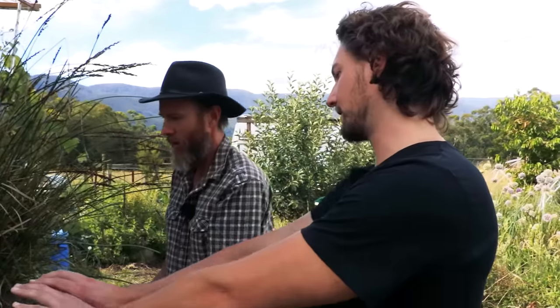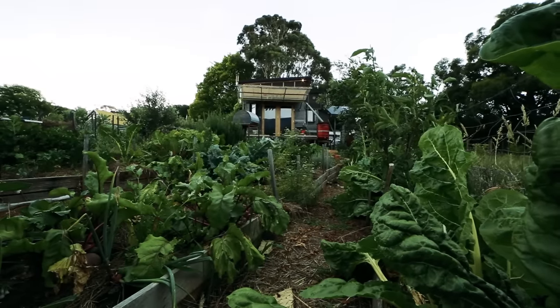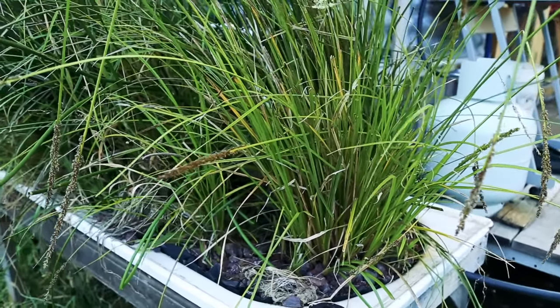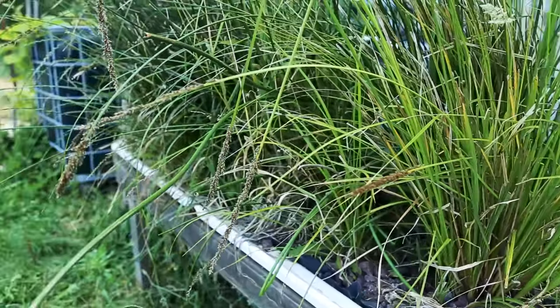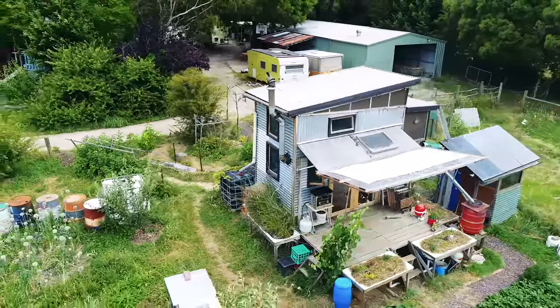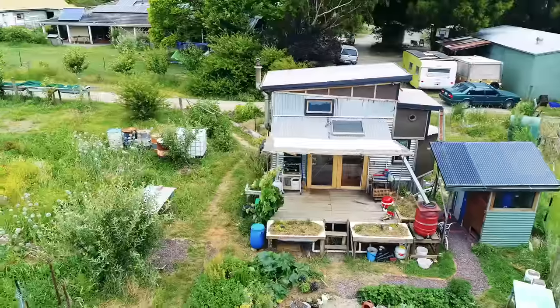So you end up with a layer of grease and fat at the top, which is intermittently cleaned out. I think I could go a year and a half to two years without cleaning it, especially since I'm using biodegradable eco-friendly detergent and pitching washing water on the fruit trees or berries to take the load off the system. When you do empty the grease trap, it can go in the garden on a fruit tree — you don't want to put it on leafy greens — or it could go on the compost.